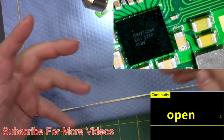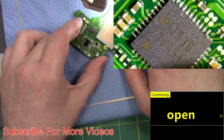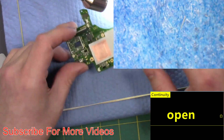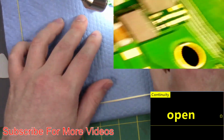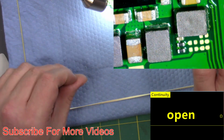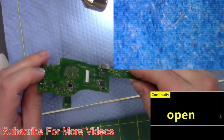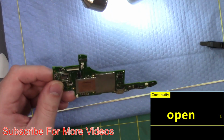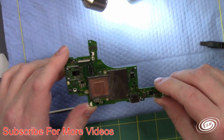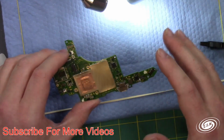But if it works and it plays, and if it's a playing-on-the-TV problem, I know it's most likely going to be this audio video chip, and power charge control chip here, this combo chip M92, so I can replace that. But I can also use it to check to see if this truly is the way it's supposed to be on a working switch. Like I said, I don't have a known good board here right now, but if I fix this one all the way, or I don't, I'm sorry, if I fix this, I am going to keep it most likely as a known good, or I'm going to keep the other one that's coming that doesn't connect to the dock as a known good board.